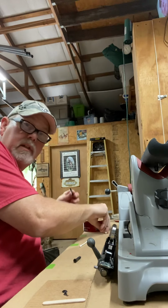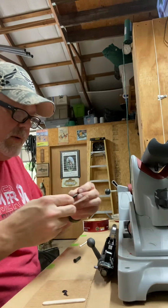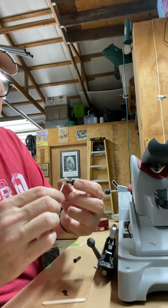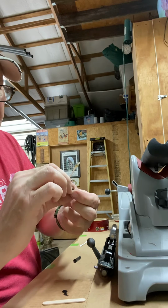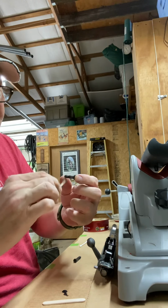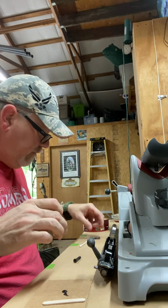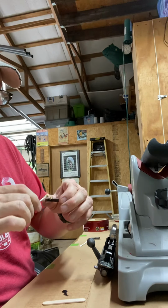I'm going to wax these bolts. Wax them up good. Get bolt wax in the threads all down the bolt itself, you know. So I'm going to put it in there and just rub it in real well. The last thing you want is this epoxy to grab a hold of anything other than wax, or where you want it. I mean, naturally you want it to grab a hold of the stock, but nonetheless, put a little on here.